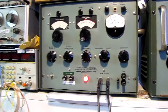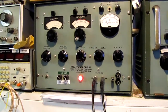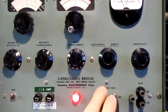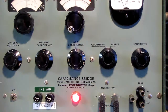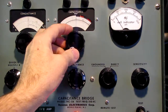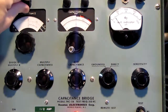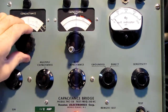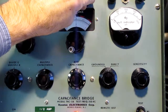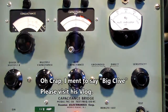I'm going to hook the cables up to the calibration standard on the table. I have two cables connected — the low side cable is connected to the standard, and the high side cable right now is floating. We're going to null the meter to compensate for the length of the cables, so I'm going to return this dial to zero and trim these in. As Big Clive would say, it's fiddly — it takes a little bit of time to dial everything in. That's close enough to a null.